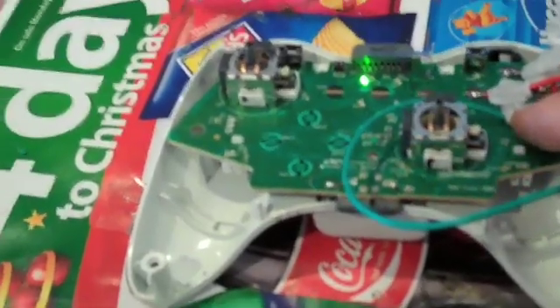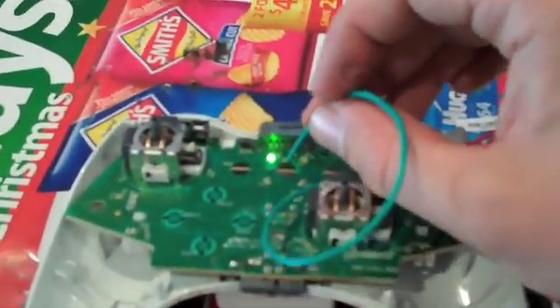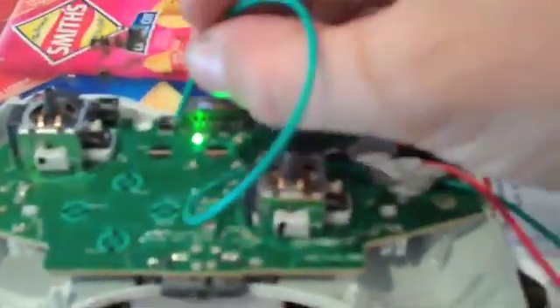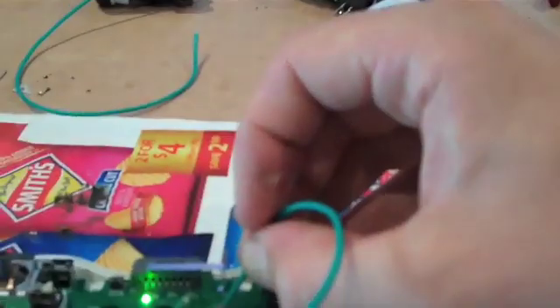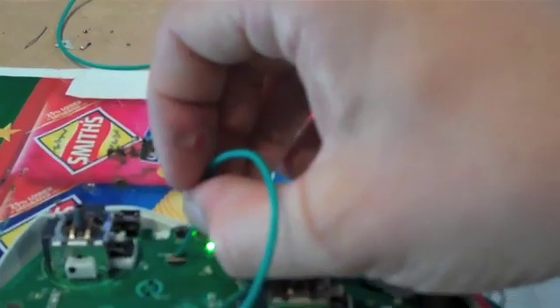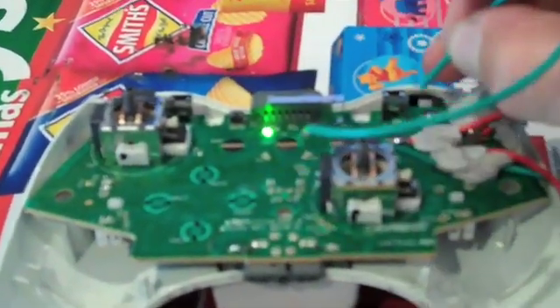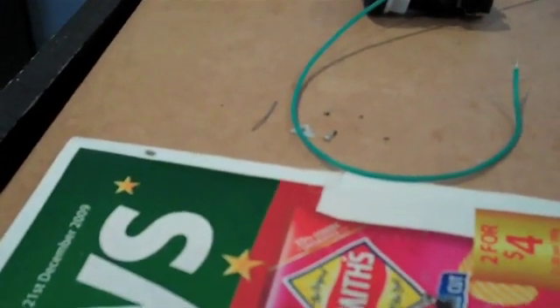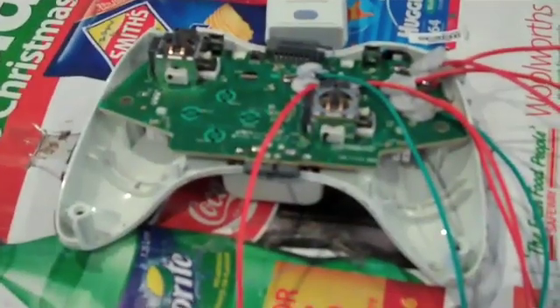Here's a demonstration of finding the signal and the ground. I've jumped from where ground is over on the green wire, and now I'm just going to attach the contacts to try and find what the signal is for each button. That bottom contact is the Globe button — whenever I touch it the Guide pops up, then goes away. Start and Select I can't easily verify without another menu. Then RB — yes, that's definitely RB flashing on screen — and LB — yes, that's definitely LB. I've now got signals identified for three more buttons.